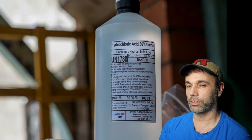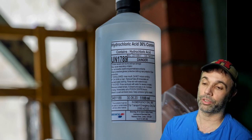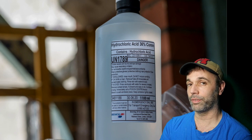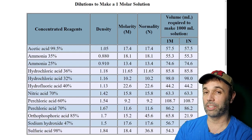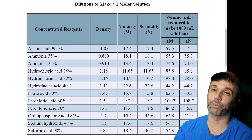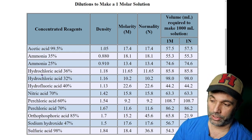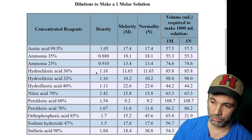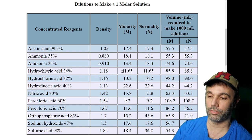This way of describing its strength is a bit inconvenient. If it described its strength in terms of molarity, it would be much easier to do the calculations. For example, if this were 2 molar hydrochloric acid, we could just mix it 50-50 with water and have our 1 molar solution. Fortunately, we live in the information age — you can do a bit of googling and find tables for working out these dilutions. Our 36% hydrochloric acid has a molarity of 11.65.